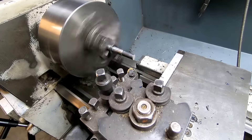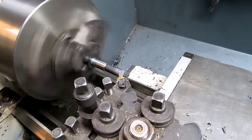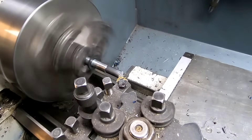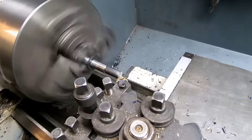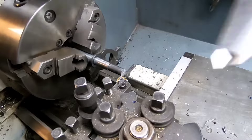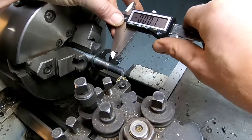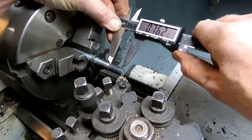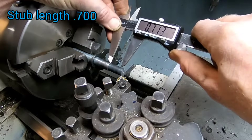Now that we've got that cut off with the hacksaw, we're gonna do some exploratory machining here. Deep inside there's a bit of a pocket that was left when I pushed this all together, and basically we're gonna measure twice and cut once — just cut the end off in a rough way to find the tip. Then we're going to bring the edge of that collar right up to the tip and call that good.